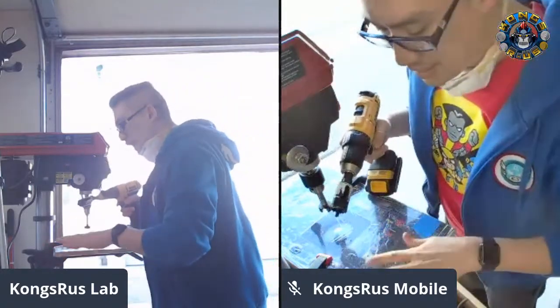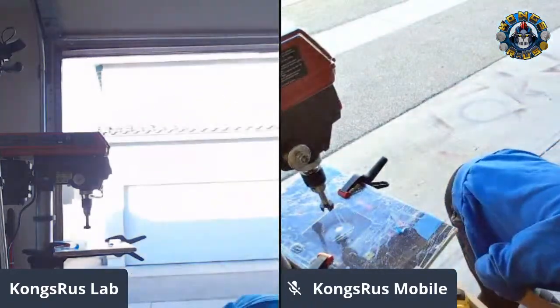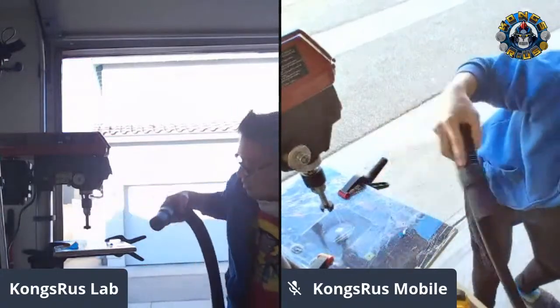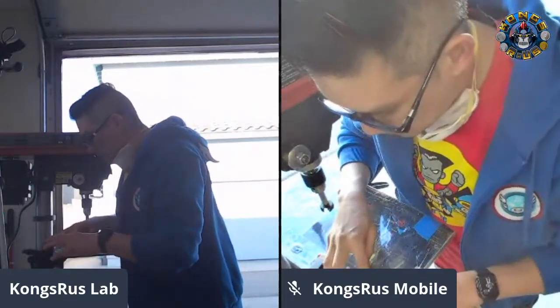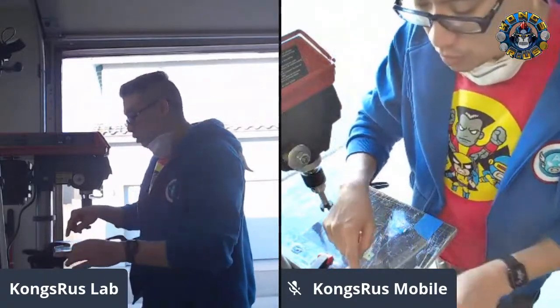And then you're going to be pressing this up into the hole saw while you're drilling down. So you can see I have a pretty clean cut here. Just cleaning out the area section. I have no cracks in my plexi at all. So this was just a nice clean cut on the plexi side of things. And then I'm going to drill the rest of it through.